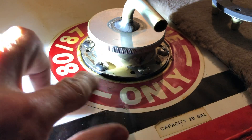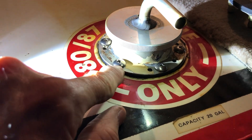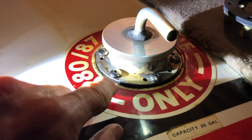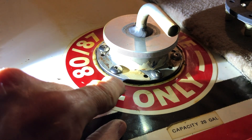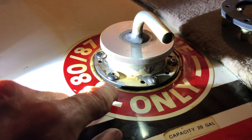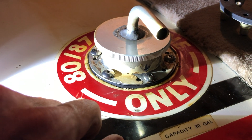I came back after about 15 minutes and retorqued it — the gaskets are taking a set, so I was able to retorque them to 15 inch-pounds. Make sure it's inch-pounds, not foot-pounds. I remember using Real Gaskets on the valve covers — it did indicate to torque them down and then come back and check again, as the gaskets tend to compress just a bit.